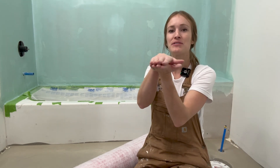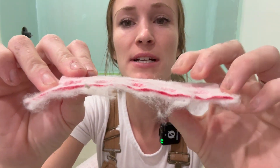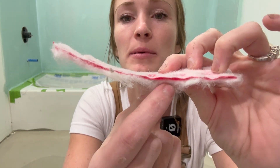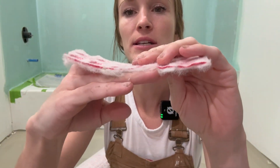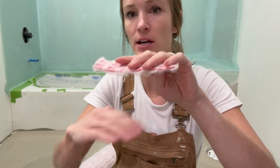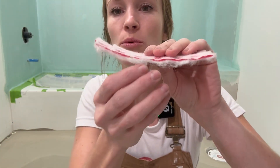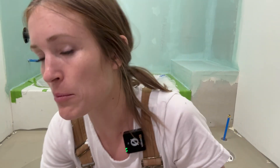When you install flooring you need to uncouple — basically have something that makes it where damage down below does not transfer to your top layer. Looking at a cross-section, you can see you have the plastic with a little bit of felt on the bottom and felt on the top. You attach this to your floor, and when you tile it goes on top. When there's movement, the felt and these layers allow a little bit of movement in the fabric versus transferring to the tile and cracking it.